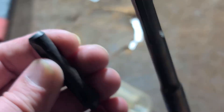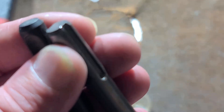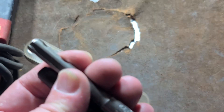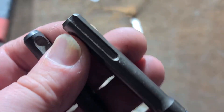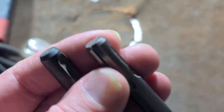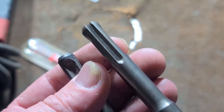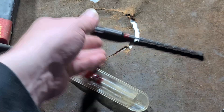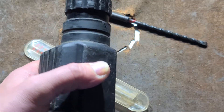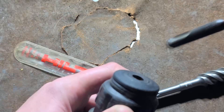The only thing you have to remember is that these old bits won't fit in new rotary hammers because they don't have these slots. But wisely, when Bosch introduced SDS Plus, they made it so that newer bits off the shelf can be used with old rotary hammers, such as this old Milwaukee Falcon here. This Milwaukee Falcon can accept either.